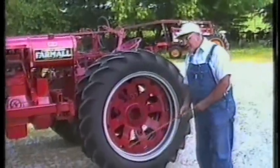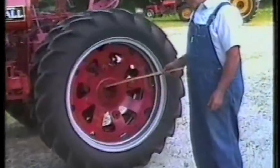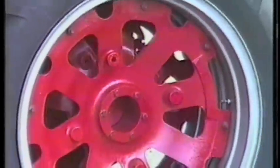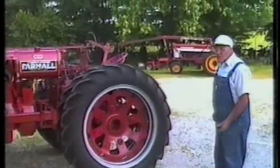Here are the wheels — about all I had to do was just take another set of wheels and bolt them right on. I went and bought special bolts right here. They're ten and a half inches long, grade-eight bolts, and we got the thickness pulled out of them — it just works very good. It's got a 12.4 x 36 tire on it.